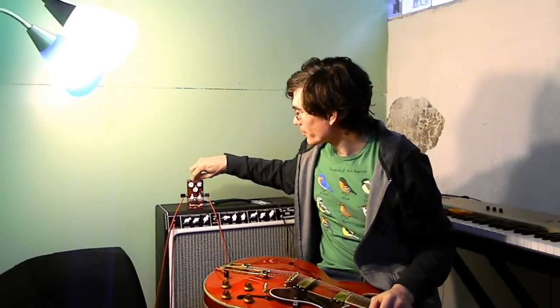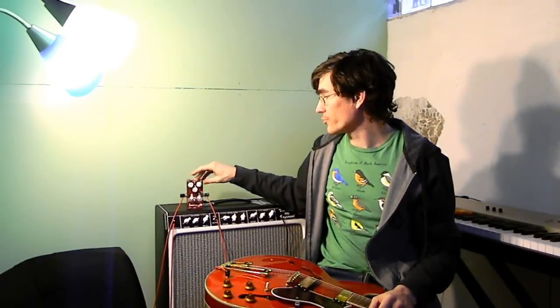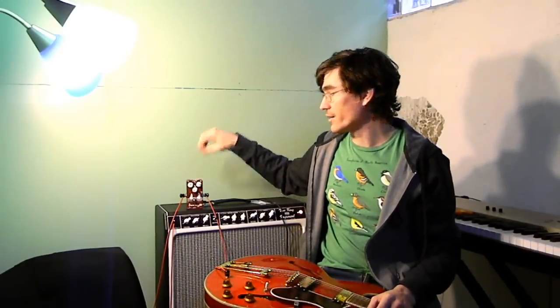In the center is a really cool little switch that turns on a miniature compressor. I learned this from a guy named Aquatar in Germany, who did it on Runoff Groove's Humble circuit. I decided to try it here and liked it, so I added it. It's got three settings: no compression in the middle, low compression on the left with a higher threshold, and high compression on the right with a lower threshold that just lets everything through.